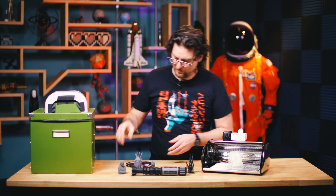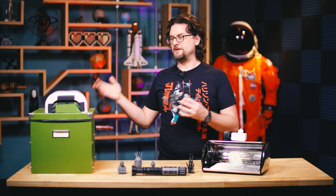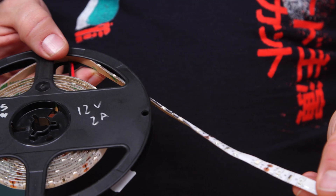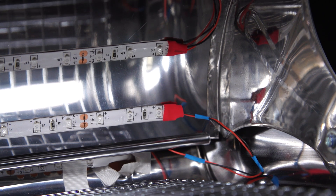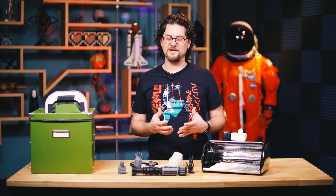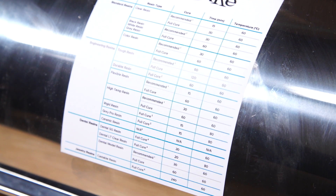I paired all of this with a DIY roll of UV LED strips at the proper wavelength — up to 405 nanometers, which is the same wavelength as the laser in the Form 2, so it will cure as efficiently and as fast as possible. These are just 12-volt strips that came with a power supply, and they have marks where you can trim them. I cut about six different strips that I wired and mounted inside the lid, so when you close it there's a whole bunch against the back and the top. I skipped doing them on the bottom since light reflecting off the floor that close to the model seemed sufficient, and that has proven to be true. The key is you have to time all of this, so I made a custom label using the Formlabs cure times so I know what to dial in for each different resin.